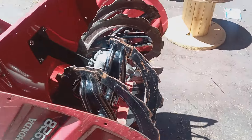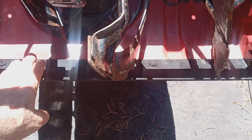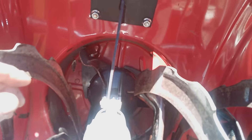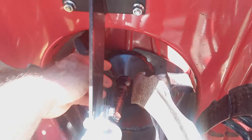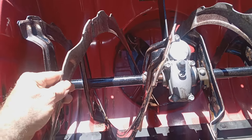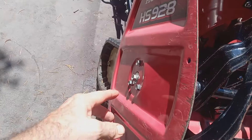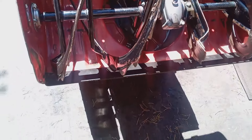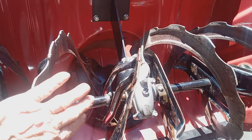The augers were bent on this — not too bad, but they were bent. The housing guard was worn out and had to be replaced, that's about $75 right there. The inside bolt was missing, the impeller pin was missing. This auger was seized — when you took the shear pin out it wouldn't turn, so it had to be freed up. The bolt was removed and some lubricating oil was sprayed in to free it up. Now it has a new housing guard, new pins, and the augers were straightened out.